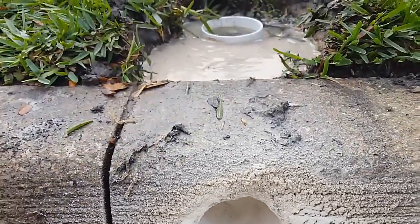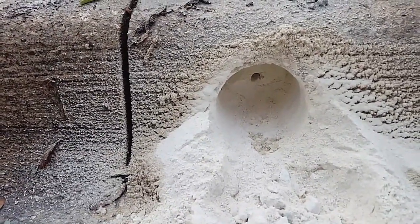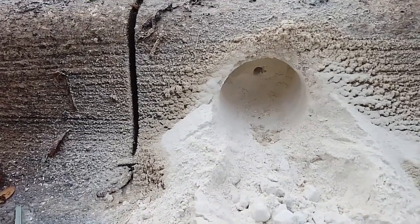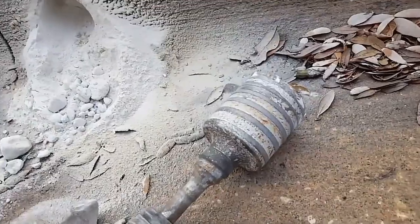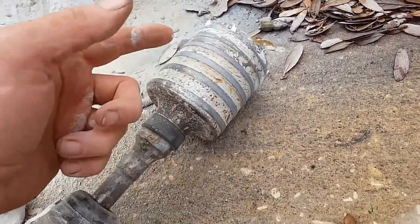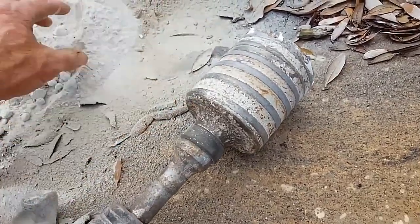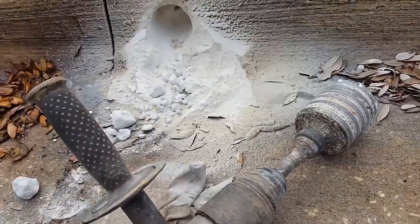This takes a pretty wide curb — it's about six and a half inches. This takes probably about an hour altogether, and it is a little bit demanding. You've got to keep pushing on the hammer drill. But what a neat tool — diamond core bits. You can see the grooves to help pull the debris out, the waste. This is the concrete it's pulling out, and it just goes right through there like butter.